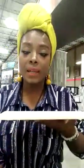So porcelain is stronger. The other thing that I want to talk about with that is a lot of porcelain and some ceramics are coming with rectified edges. If you look on the signage in the store, or if your installer tells you, based on what you asked them for, okay, you have to get a rectified tile, there's reasons for that, okay? This is considered a pressed tile, all right?